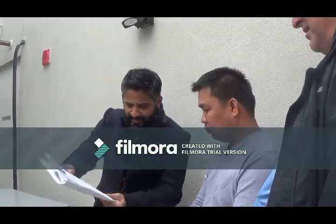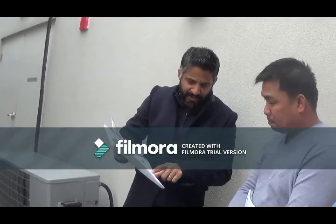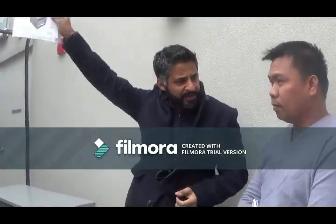This is a very vague picture of nozzles, right? There's little nozzles. You need to make sure those are clean. I don't think there's a heater on this project. No. Because two pipes, no. You don't have heaters for the winter, right? Okay, so you don't even need to worry about that. So those are the things you need: the water treatment, the strainer, and the nozzles on top. That is what you do from the water side, and passivation, of course.